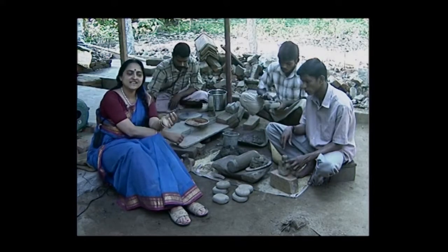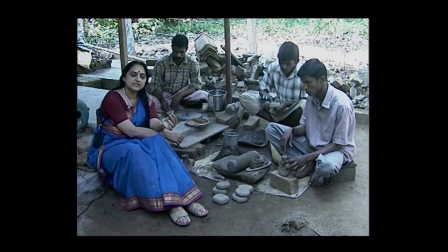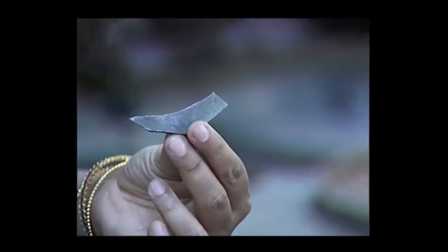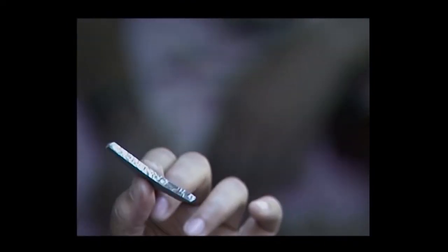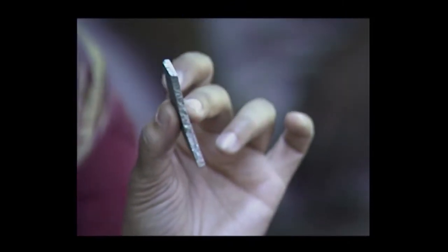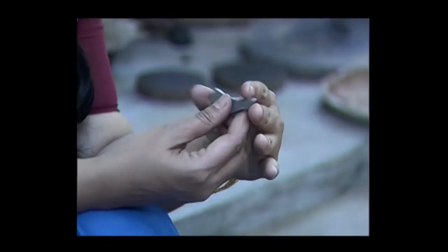This is what I call a delta bronze alloy. It has 33% tin in bronze and this I found out by microstructural and SEM analysis. This alloy is chosen because it is a very silvery white colour, and although it's a very brittle metal, they cast it in a very special way so that a very thin blank is cast of a homogenous alloy so that it won't break more easily.